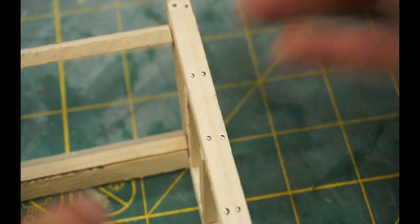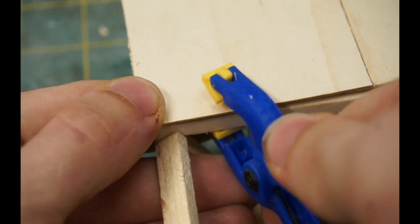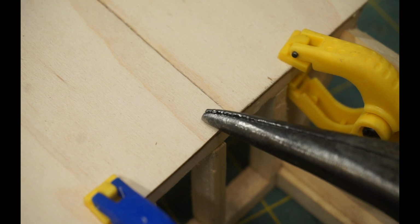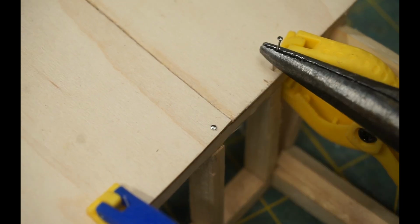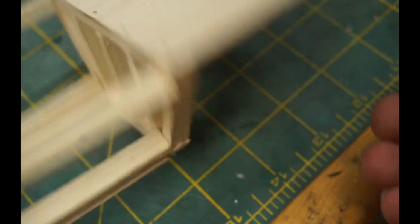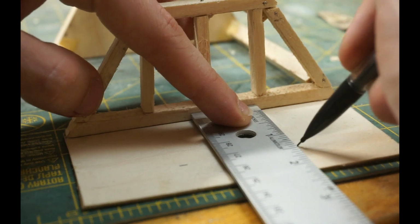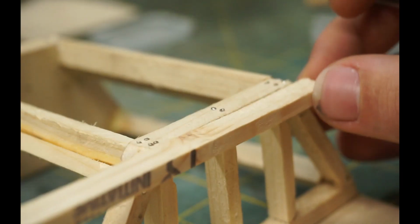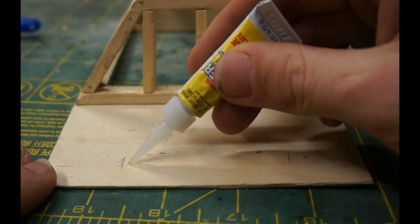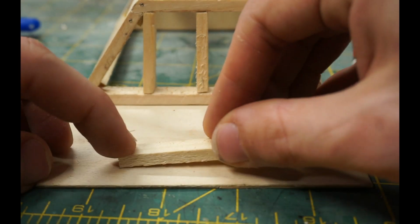Next, it was time to frame the roof. I'd never framed a roof before, so I looked up pictures of bay window roofs online to see what is typically done. I ended up mostly copying one of the pictures I found, and I started by attaching a partial sheet of plywood to the back of the window. The ridge member of this roof is then attached to the plywood.